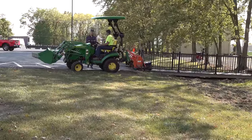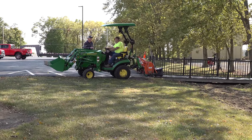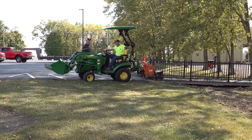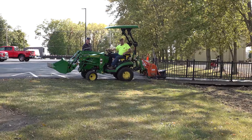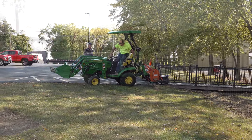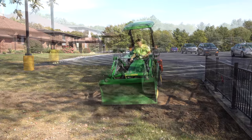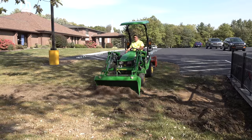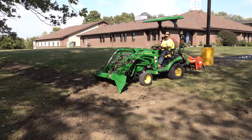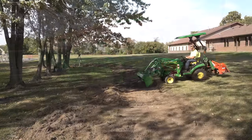That's an excellent route — I don't think we need any water in that. Didn't hit too many roots going that route? Yeah, got a lot of roots. That's going to be a problem. We're further from the tree than we would have been otherwise, so they should be a little smaller. I think I'm going to take the tooth bar off. Given that this is already loose, I think the flat edge bucket may be the easiest way to handle this. I was afraid I didn't have room on the tree side of this ditch, or I would have back dragged the entire part — it would just be so much easier to use a back drag motion than pushing forward. But the space just didn't allow it, especially around the corner where we have the level set up.